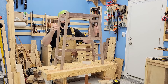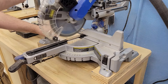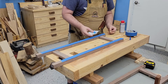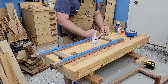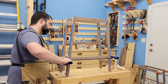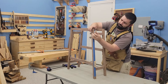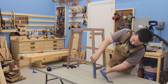To assemble and glue this together, the sides aren't parallel to each other, so I had to cut out little blocks with five-degree cuts on them to create a flat clamping surface. To make it easy, I put blue tape down the side and then used some quick adhesive glue to create these parallel surfaces for the clamps. When it's all done, it's as simple as popping off the little blocks and peeling away the tape.